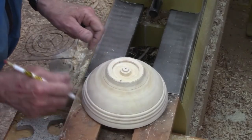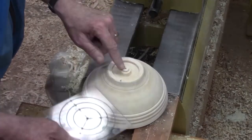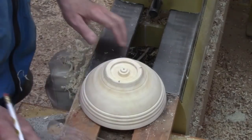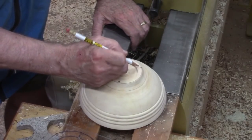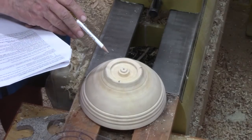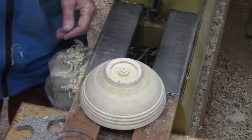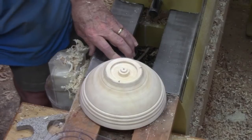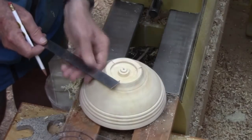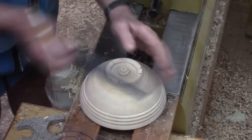I'm just going to go ahead and mark that just a little bit off center. Now I can line this up. In the earlier video, I said we're going to make these legs three quarters of an inch, so put a line three eighths inch on each side. Viewer Michael Wartman made the following suggestion: when you're laying out the feet, you can save work — instead of defining the center and then offsetting it three eighths each side, define one edge then offset it to one side by three quarters. What a great idea, Michael, thanks for that suggestion. So I'm going to mark three eighths inch on the outside of each one of these feet, then come off three quarters of an inch, then we come in a little bit on each one on the center to get that angle — that's the shape of the foot.